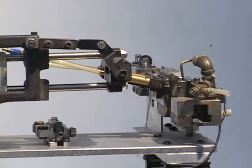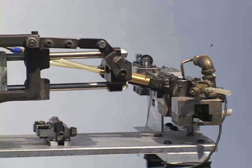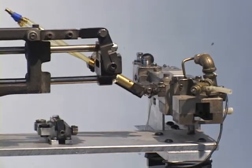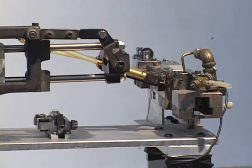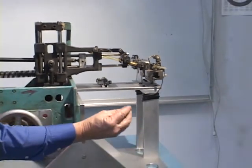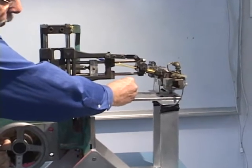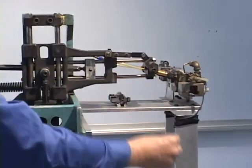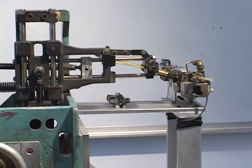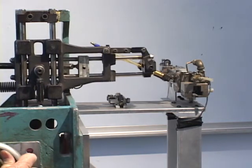It's a consumer product, one that's made in fairly high quantities at fairly high speed. This is one of perhaps a half a dozen stations on a machine of this sort. And these are typically conveyor machines, so the parts are being assembled on a conveyor that moves and stops, moves and stops, moves and stops, moves and stops. The final stop being here, this is the unload station for the finished product. So in the previous stations, it would have been adding parts. It puts the first part on in the first station, moves it to the next station, adds a part, et cetera, until it is a complete assembly.